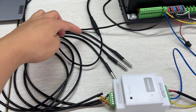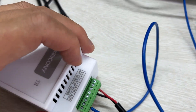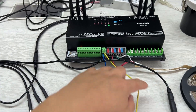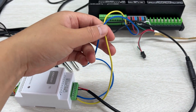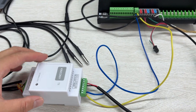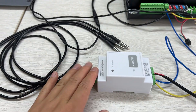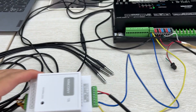I have connected the sensors, and I've connected a 12 volt power supply — you can also use 24 volt. The A and B terminals are RS-485, connected to the AIO board. This cable supports long distances — the maximum is one kilometer — so it's sufficient for your IoT project, because it uses RS-485. The structure is very simple: just connect the sensors and connect the RS-485 cable to extend sensor range over long distances.